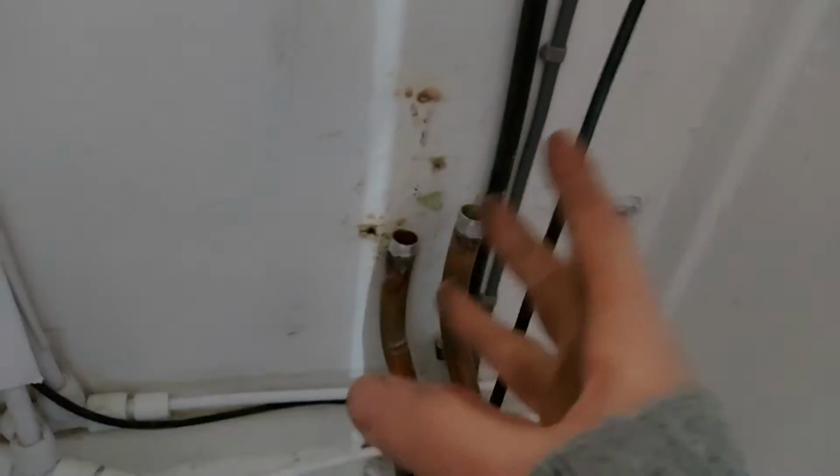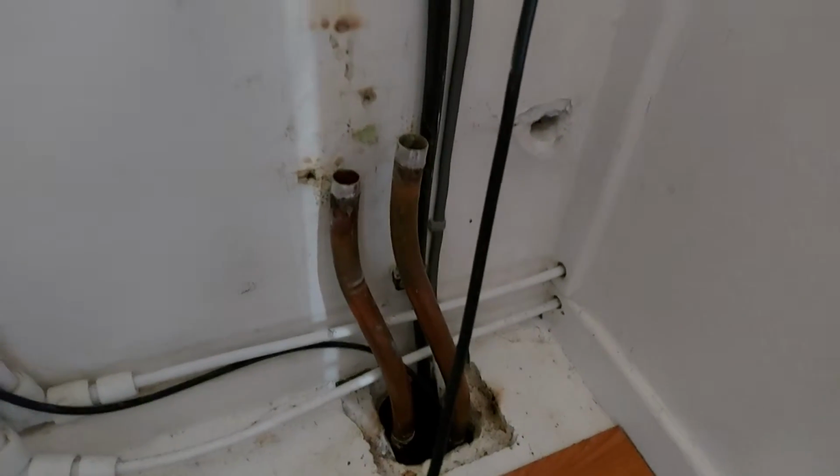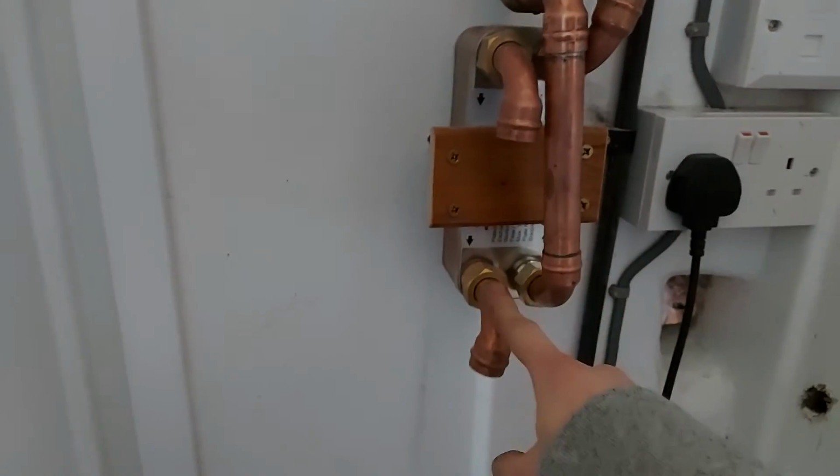But anyway, as for this side of things, I've still to put a circulation pump in here, and I'm not sure, but I think circulation pumps always have to be sitting horizontally. I don't think you can have them sitting vertically, where the inlet's coming out the bottom and coming out the top, or the other way around. If anyone could give any confirmation of that, that would be much appreciated. But because it would be more convenient just to mount the pump vertically there, and then it'll just be on the wood burner side of the circuit.